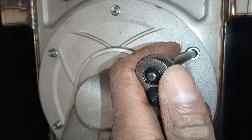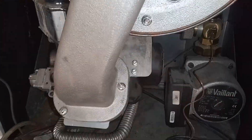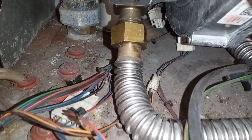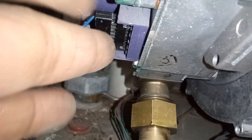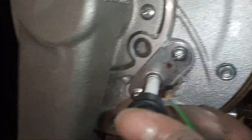It's up and twisted so it's in there, hand tight at the moment — time to tighten them up. Connections time: gas valve gasket back in, tightened up. We've got our connections in — modulating and fan speed connection, fan connection, live, neutral and earth, gas valve connection, spark electrode connections, and the earth electrode plug. Air intake reconnected.